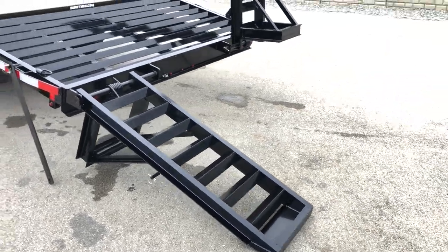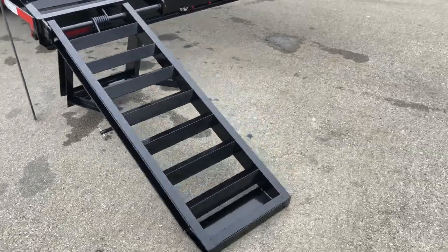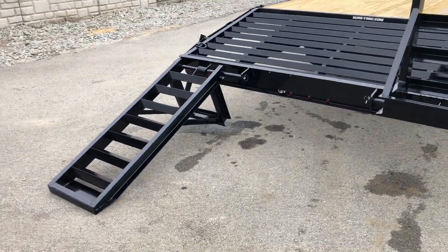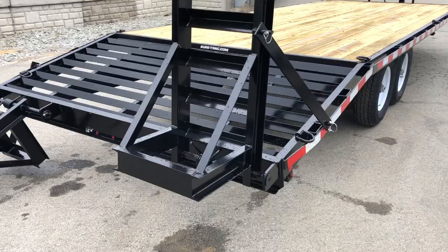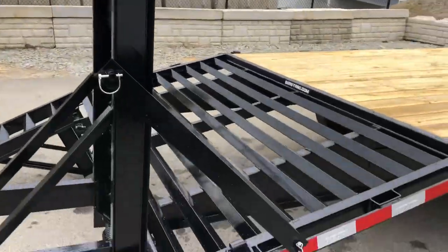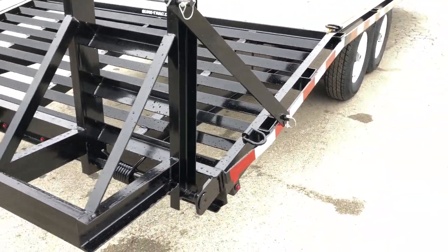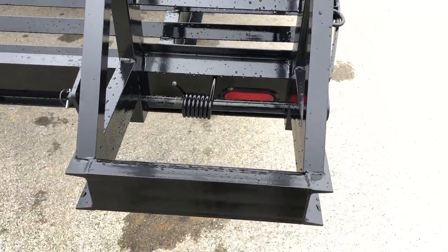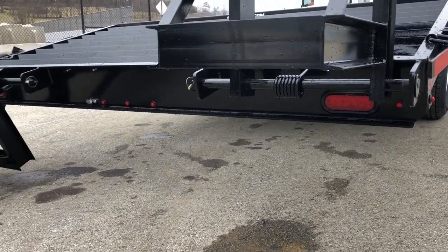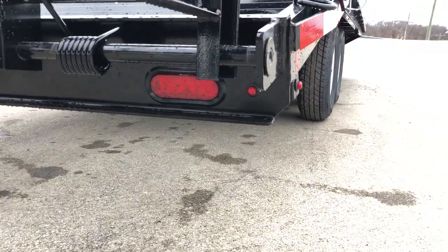These have a four-foot beaver tail with a five-foot stand-up ramp. The ramps are a little heavier than an equipment style — normally on a 14k equipment trailer you'd get three-inch channel, but these are four-inch channel, so a bit heavier. It's got a self-cleaning beaver tail with your D-rings at the back. It also has spring assist and all LED lights. They put an extra marker light on the outside, so you've got your three center markers, your outside stop/turn/tails, and then an extra set of markers.